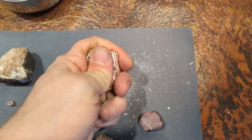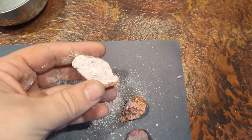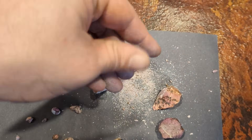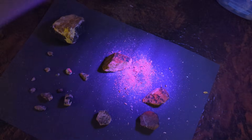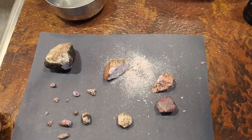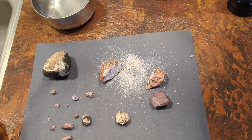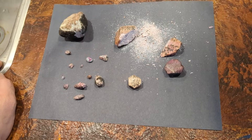I bet I could break it. So that's something to keep an eye out — if you take it up to those temperatures and you're not doing a glass fill, this thing could just fall right apart on you. And it is all ruby — if you shine the light on it, it all fluoresces. So now we know what happens when you heat treat rubies at about 2300 to 2400 degrees for a few hours: it certainly does treat the color and removes a lot of impurities. It does make them weaker, however. And the colors get much lighter if you're relying on those blues and purples to deepen them up.